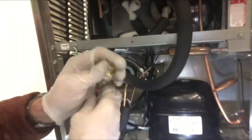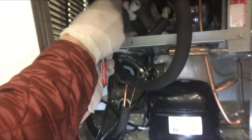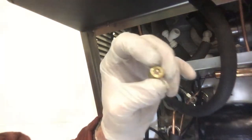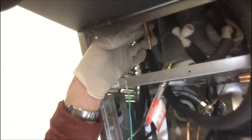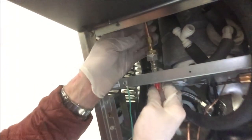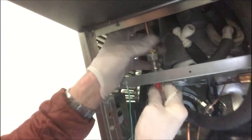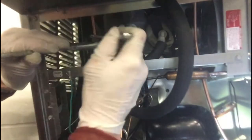Just got done tightening the hose to the water valve there, so let's go ahead and put the compression fitting on the drinking fountain side there. This piece goes on first, a little nut deal, then the compression washer deal will go on next. Got both slid on there. I think you guys can see that. I like this hose idea a little bit better, so we can flex it there. Here we go.